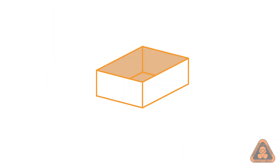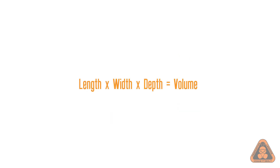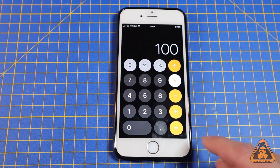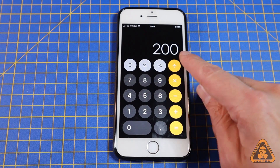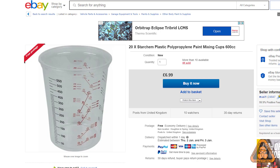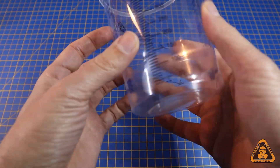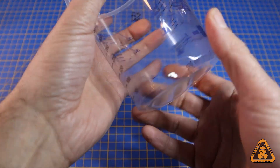To avoid waste and save money, do a little maths by working out the volume of the box. Multiply the length, width, and depth: in this case 10cm × 10cm × 2cm gives 200 cubic centimetres. Although mixing cups cost more than standard water-cooler cups, they're important because some chemicals can melt cheaper cups. They also come with handy measuring increments on the side.